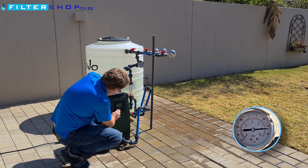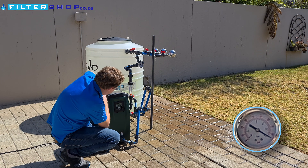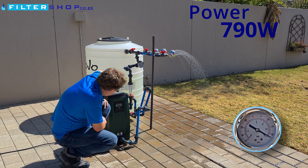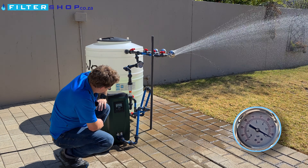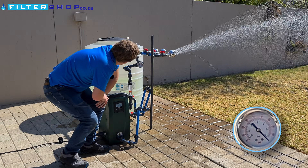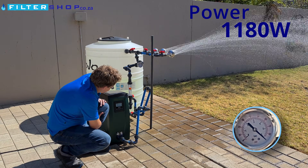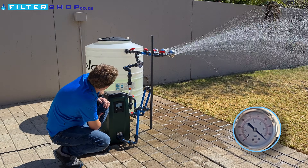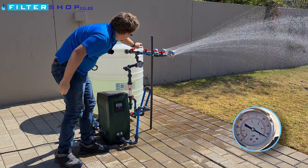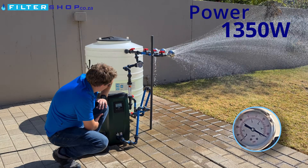Let's see if it'll manage something at 6 bar — I think 6 bar is the highest you can set the unit to. With a small load drawing 790 watts, with a single shower drawing 970 watts, and we're actually keeping 6 bar at the pump. Opening a second shower at 1180 watts — it's just dropping under — supplying 5.9 bar at the pump at 1800 liters per hour, which is very impressive, but that is quite a bit of power consumption. Opening a third shower, we drop down to 5.4 bar and again 1350 watts, so I think that's flat out.